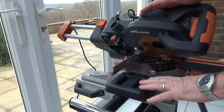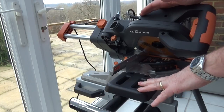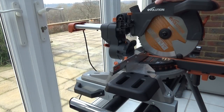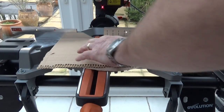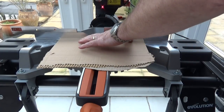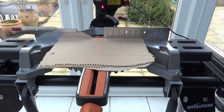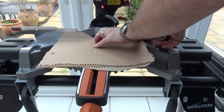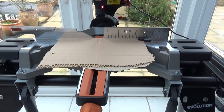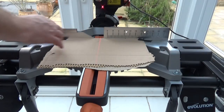Those are the three angles you need to check to make sure the miter saw cuts accurately, and you can do it in about 10 minutes. The very last check is to make sure the laser is in line with the blade. The instruction manual says to use card — you can cut a groove in wood but card is much easier. Stick it down onto the table, make sure it's pushed against the fence, and that stops it moving when you work with it.